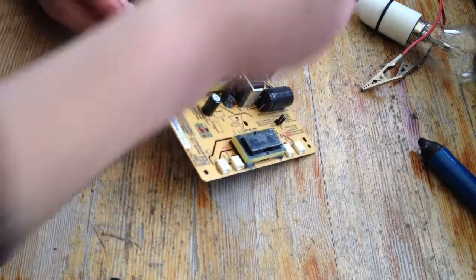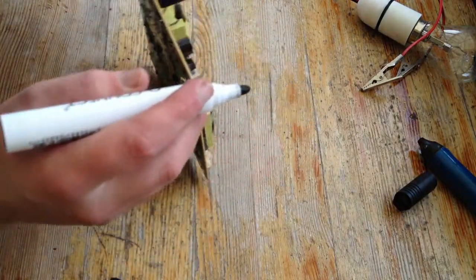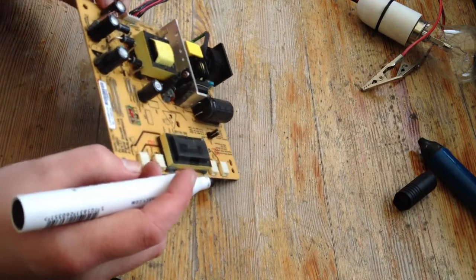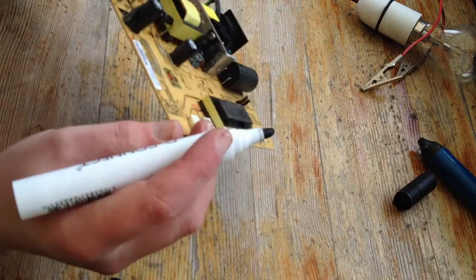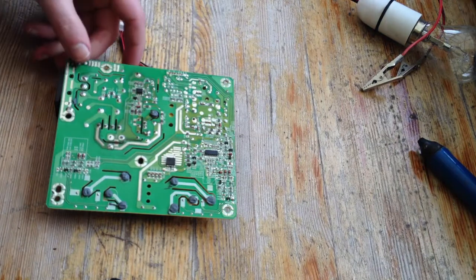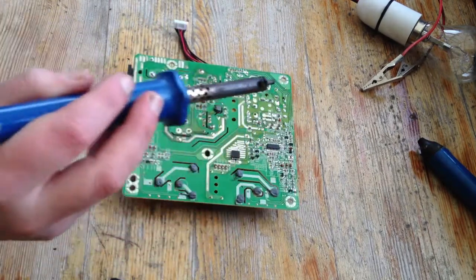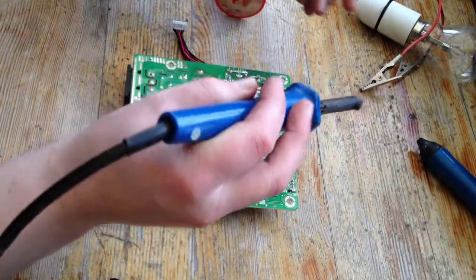So we're looking at our two capacitors. What I normally do is mark the negative lead of the capacitor, so I know where each capacitor physically is on the back of the board — because you're looking at hundreds of solder joints — and so I know which side is negative when I go to replace it. Polarity is important on electrolytic capacitors, though not on all capacitor types. Once I have them marked, I then desolder them.